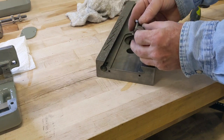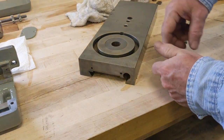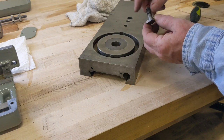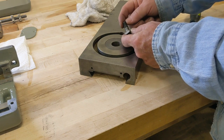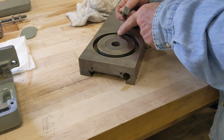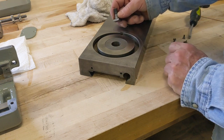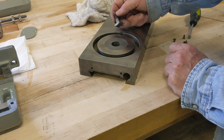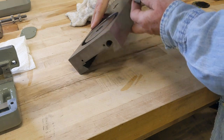So these are the compound bolts right here. On my Chinese lathe there's a larger hole where you can fit these things through, but on this lathe you can't. On the first lathe I did, one of these screws was stripped. You can see it has an arc machined into it with the same radius as the sides, so they fit in this way. I contacted Monarch to buy replacement screws — it was like a hundred dollars — so I wound up making them. On this machine these are fine, so let's get these in here.